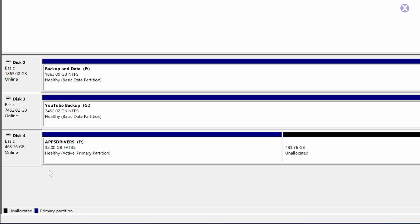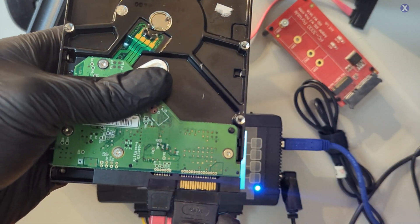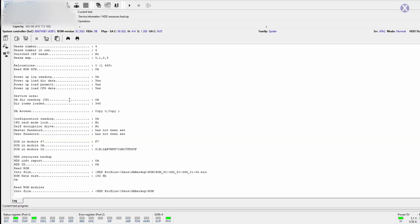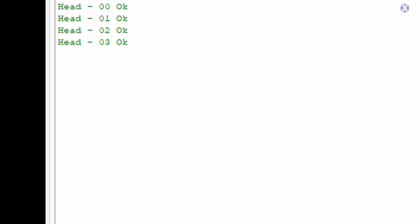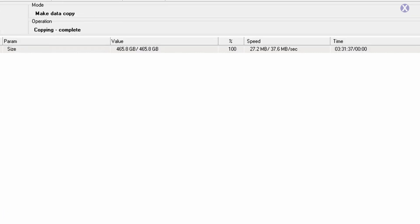Because of the risk involved, we don't want to push anything further with Windows. We're going to use our advanced data recovery tools and disconnect from Windows first. These tools help us work with the drive in ways Windows can't — we're able to see the drive information, work with it, and see the multiple different heads. There are four heads here and they all look to be okay based on our checks. Once we do that, we can see the partition that has the data, and we'll go ahead and image it to recover the data for the customer.